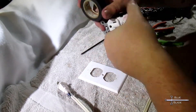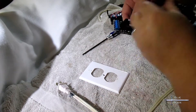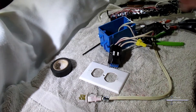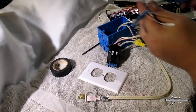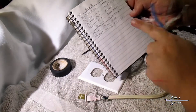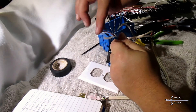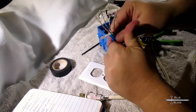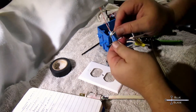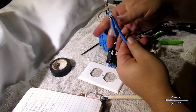Once the outlet is connected, a bit of electrical tape is applied just as a precaution. Now to connect the signal wires for the SSR — I cut a 9-foot section of CAT5 cable to connect from the controller to the power strip, and then a 2-foot section for the relay signal from the power strip to the SSR relay box. I strip back the sheathing to expose the wires. Looking at my notes, I'll only be using the blue and orange pairs for the SSR relay, so the other two pairs are pulled down and twisted away.